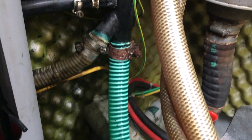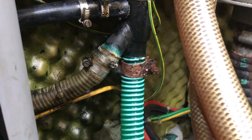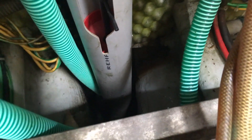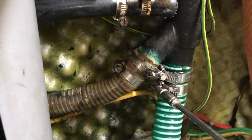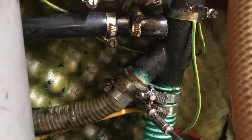The raw water comes in there, up through the sea chest filter and then down here to the engine. That hose clip is very rusty so I've got to replace that just as part of the service. It was actually seized in place. I'm replacing it with two hose clips — anything below the waterline should be double hose clipped anyway.